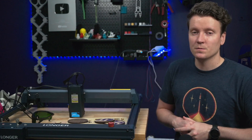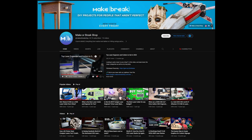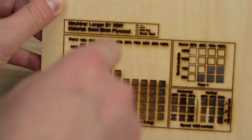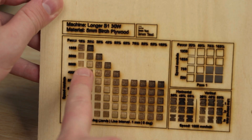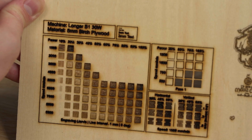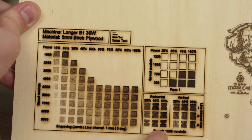When it comes to laser engraver test files, I like to use this one by the Make or Break YouTube channel — I'll link their channel in the description below. They are more experienced with laser engravers, but I did modify it a little bit. I should have modified how the letters are set because it did get a little too dark. This test shows really well what sort of power you can get out of various speeds and power levels, and down in the bottom right corner it shows the differences between vertical and horizontal lines.